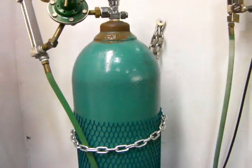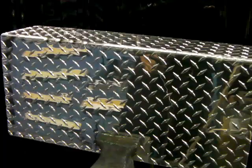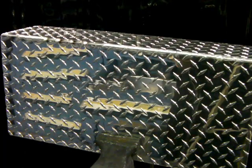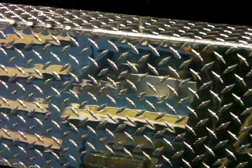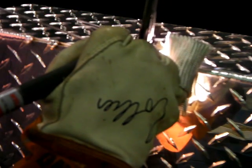When you need it, if you're like me — I've been using a Dynasty 200 DX for a while and I've gotten a hold of some things that were just too thick. But when I add helium and then add a little preheat, I can get it done, where otherwise I just wouldn't be able to — I'd have to stand on it forever to even get it to melt. For instance, a piece of one-inch thick casting that's been misdrilled and I've got to fill in a big machined-off area or hole — I'd never get that done without helium with a Dynasty 200.